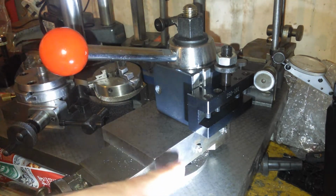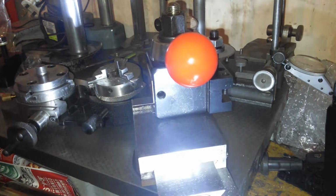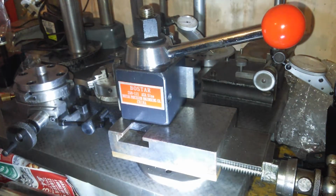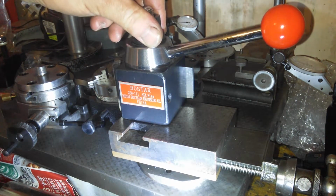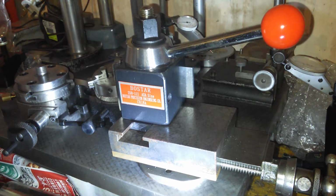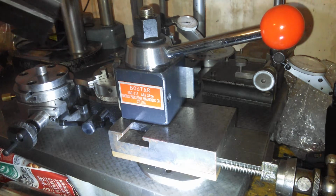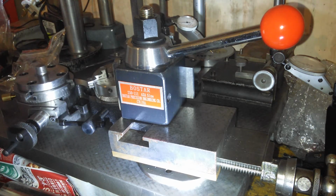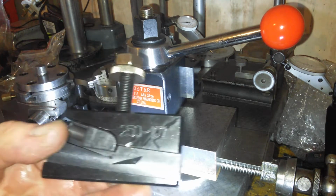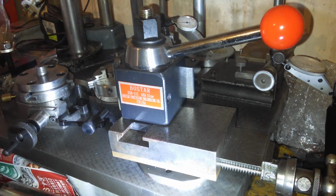Anyway, that's that done. It is done. Done, done. Spin it round. Mounted. It will be on the lathe before long. Just got some milling operations to do first, then it's going on. And I will set up all the tool holders. Oh, which reminds me, I need to find out what size parting blades, and I can do proper parting, which takes a couple of minutes instead of parting which takes 45 minutes to do a total bar. Okay. Watch parting blades.